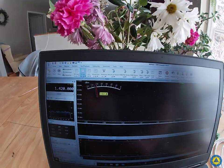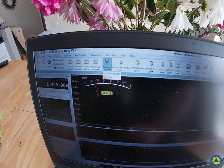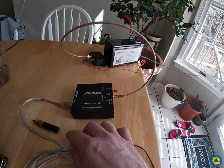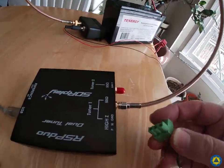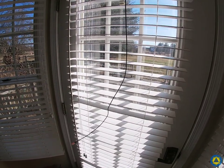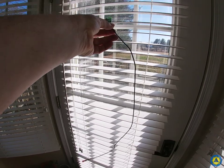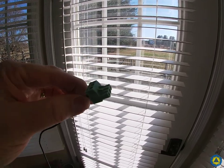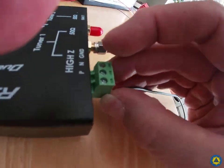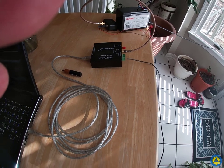But for the first task I wanted to test the high impedance input. So we select that from the SDR console, and now I have this short wire — it's only about two and a half to three feet long. You can see it here. It's a spare wire from my end-fed antenna project, hooked up to the terminal block. I plug it in and we now hear the local oldies music station.